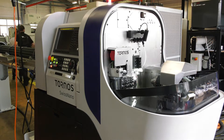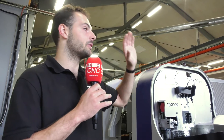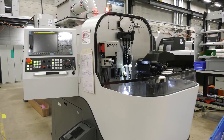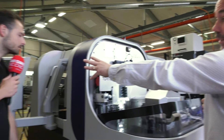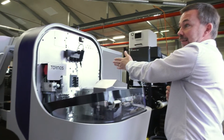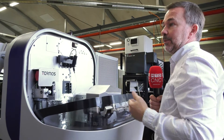Let's talk about the working area. In sliding head shops you'll see machine after machine in a line to achieve different parts in large volumes — where would the operator be working and how does that allow you to maximize floor space? With the Nano 4, 7 and 10 the design is primarily the same: access to the work area is from the front, but also from the side to the headstock, and the FANUC control is all from the side of the machine. That enables a completely clean back side, allowing you to place another machine in very close proximity and maximize output from the floor space.